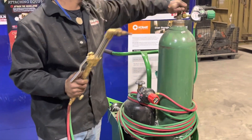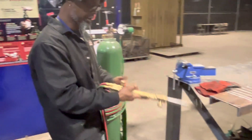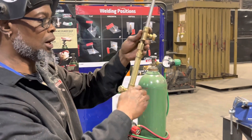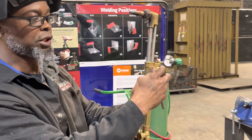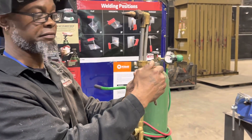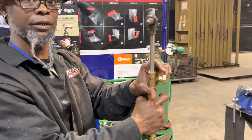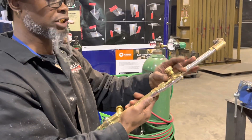So I know this has already been done, so I'm cutting everything on now and we're going to start the process. On the front of the torch, you've got a fuel gas side and an oxygen side. Always open your oxygen all the way. You want to close the valve that allows it to mix — your mixing valve. Right now you can't hear any oxygen, but it's all the way open. Once I hit the mixing valve, you can hear the oxygen coming out — it only comes out as it mixes in the mixing chamber.